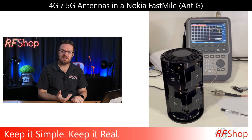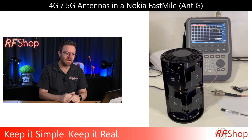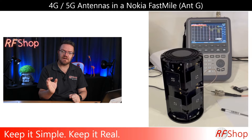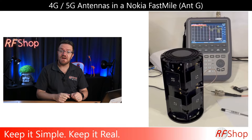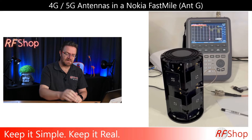The antenna seems to be really responsive to activity outside. There's a poor man's test we use: you put a hand in front and connect to the network analyzer to see if placing your hand in front actually changes the readings. That's the first thumb-suck rule — if it doesn't respond, nothing's working; if it actually radiates, your hand's presence will make a difference.